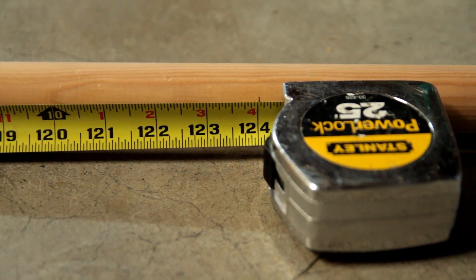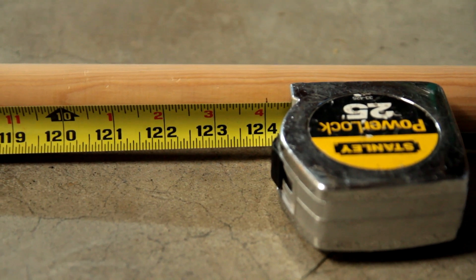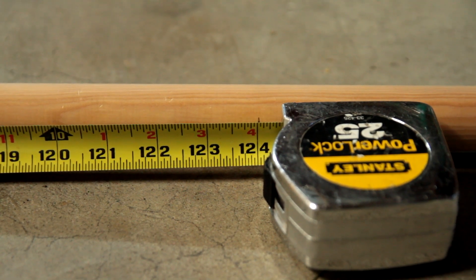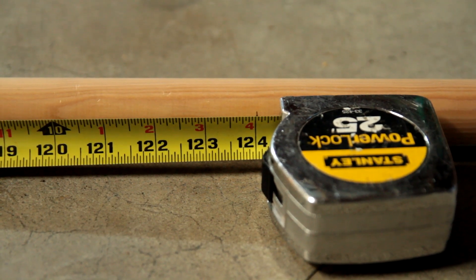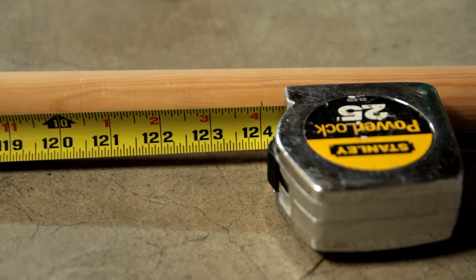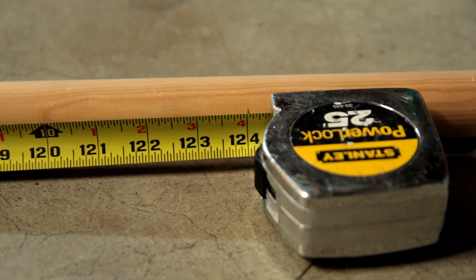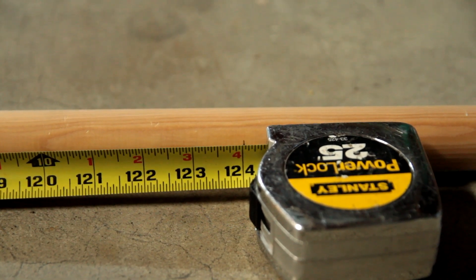Here's why you always measure twice, cut once. When I went to hang the rod by looping it through one end of the already-hung chain to see if it reached the other rafter, it didn't reach. I had assumed every rafter was the same distance apart because they looked the same — obviously that's not the case. So I need to make a length of 124 inches, which still gives plenty of clearance on each side accounting for the 107-inch-wide seamless white background. I'm going to move my hooks up one rafter.